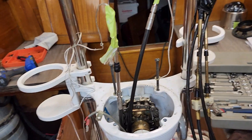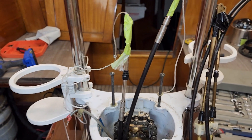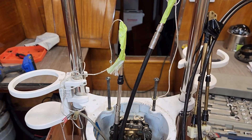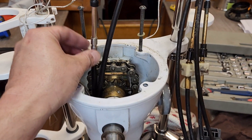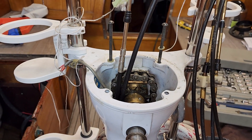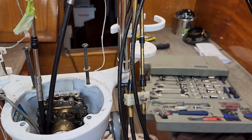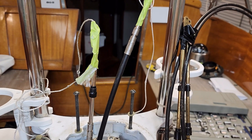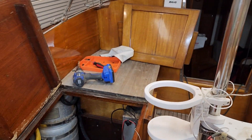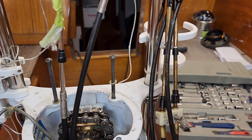We're back at the pedestal again. I didn't film this part, but I got the new cables. I went to Edson because they're not too far from me and I picked up two new cables. Of course, they are literally half a millimeter thicker than the old ones. And there is a plate on the underside of the deck that is exactly the width of the old cables at the widest point — this ferrule here. So I literally had to go into the boat and drill a half-inch hole just to enlarge it to accept the new cables. I'm covered in bronze shavings — I have man glitter now.